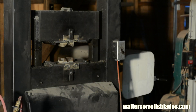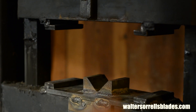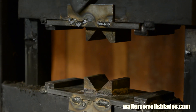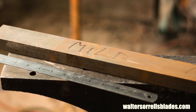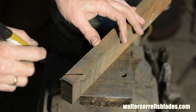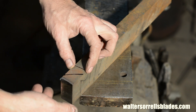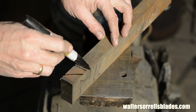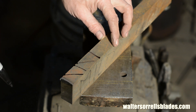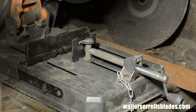Next I'll make another somewhat larger and beefier set of dies. This is going to be a little more typical of the size that you would find useful for most squaring operations. I'll use a one-by-two-inch mild steel bar to form the dies. I'll cut it on a 45-degree bias on my chop saw, then cut another piece with a square edge. This will allow me to flip the two pieces around so that when they're on the die plate, they form half of a square. Then I'll repeat the process for the matching die.